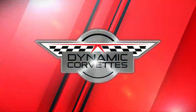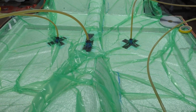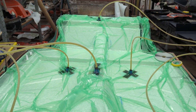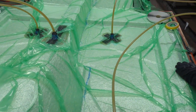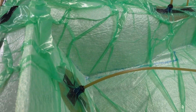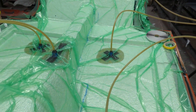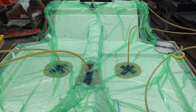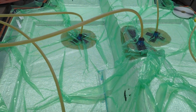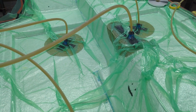The race is on — this is infusing our floor for the 57 XL project. Our floor is dropped down roughly two inches, foot wells move forward a couple inches, and so on. Infusing is basically where a bag is put over the top of the whole part, with a flange around the perimeter, and everything is going through these tubes to infuse. We've taken the air out of the bag.